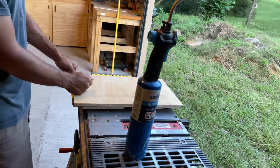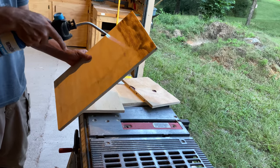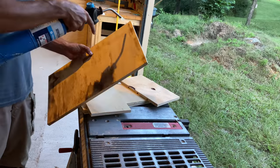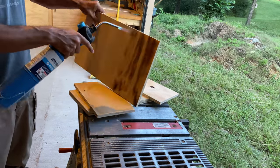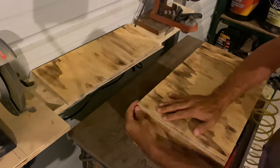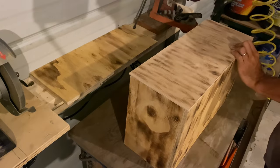After sanding, I removed any stickers and lightly scorched the wood with a propane hand torch. Repeat this for each piece of the box, excluding the shelves. Be particularly careful when scorching the quarter inch boards, as it will bubble and blister if it gets too hot. Keep the flame moving, but don't move too slow or too fast. And also be careful not to burn yourself. I then head over to my compressor and start fitting and nailing the box together.